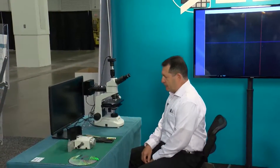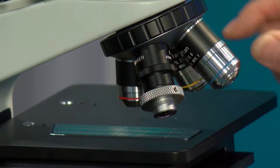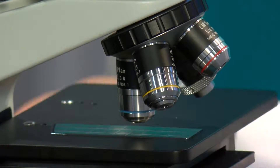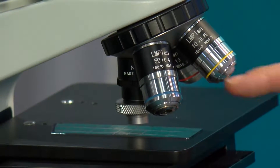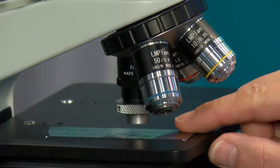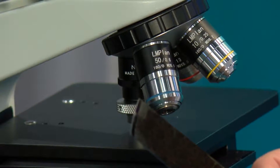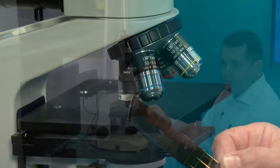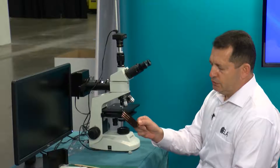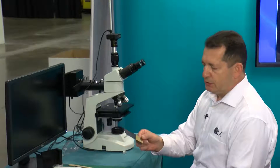Here we have a target marking objective which is used for the marking. When you put your sample under the microscope, you find your target by focusing with different objectives and then switch to the objective marker. Push the objective marker down gently and receive a very nice round circle marker — 1.5 mm inside diameter — which is visible to the human eye and easy to control your target area when you go to sample preparation.